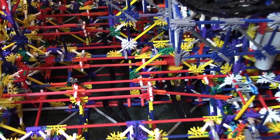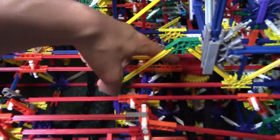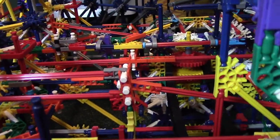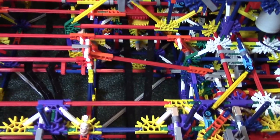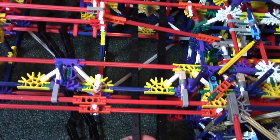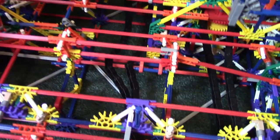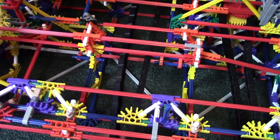I will show what I've done here before I put the paneling back on. I've basically just made these gears like they used to be — there's the second joint and the third joint is back there. They were like this probably in episode 5, and then I ended up changing them for the new robot arm design. But I will be doing it like this right now, and it's nice because these linkages were already designed to have this chain go in between them, so I didn't have to change anything with that.